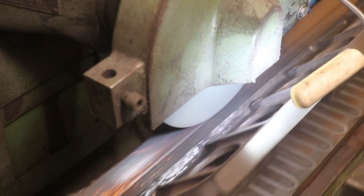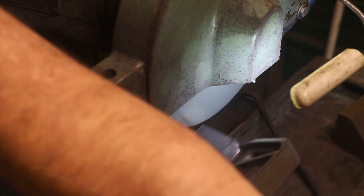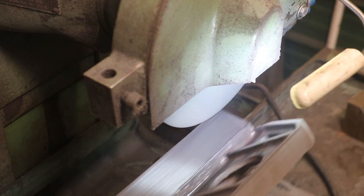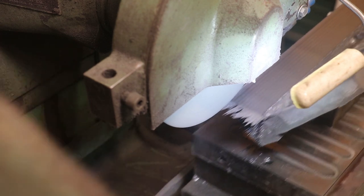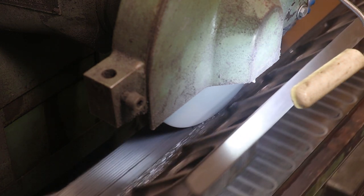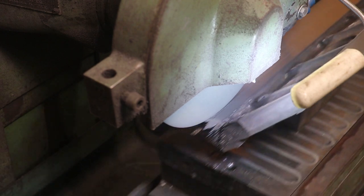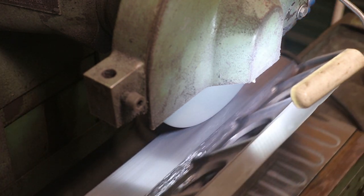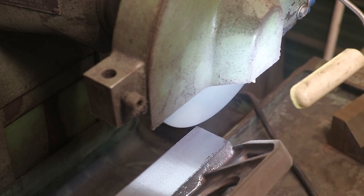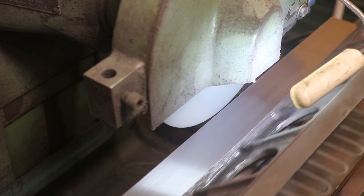Getting in the short rows on this project. We're going to do a one-tenth down feed and come back across, then just go back and forth and spark it out. All right — I think I'm pretty happy with that.